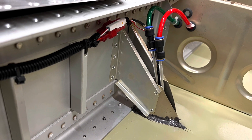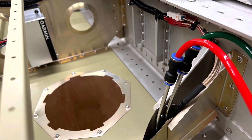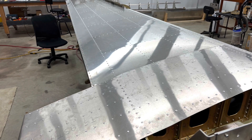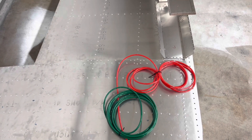This week — actually two weeks ago — I got the pitot tubes completed. I got them cut, bent out of the way, and connected up to the tubing. Then I got the top skins laid and Clico'd in place and got all the rivets installed. It was fun to get that project done.